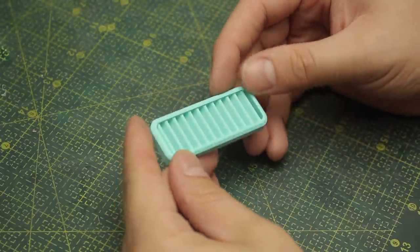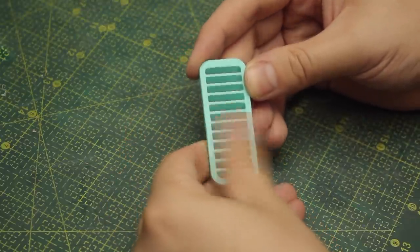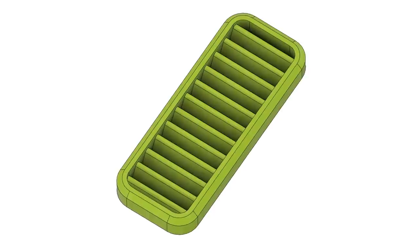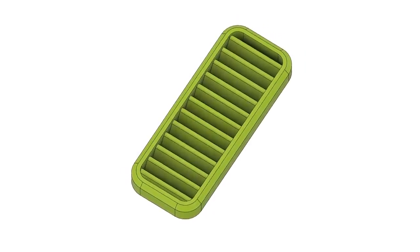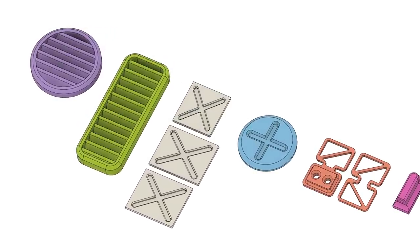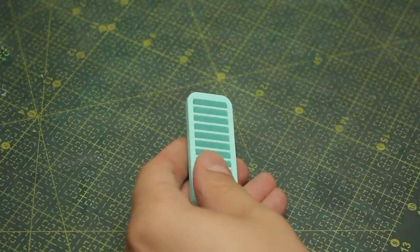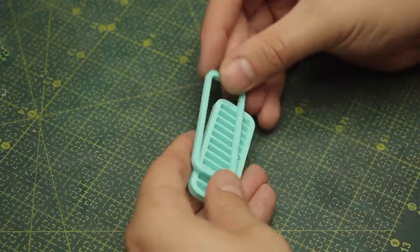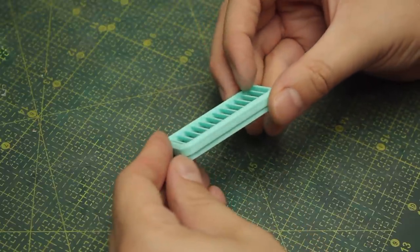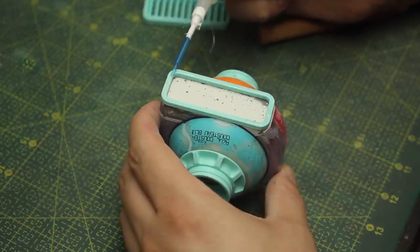For the air vent I decided to go with 3D printing. This piece was 3D modeled in Fusion 360 and I printed it at the highest resolution my printer could make - 0.1 millimeter. By the way, this design and many others are available for my Patreons - there's a link in the description. I printed the fins of the air vent kind of flush against the bottom to avoid using support material, so I also had to print a frame to create some distance between the fins and the resin.